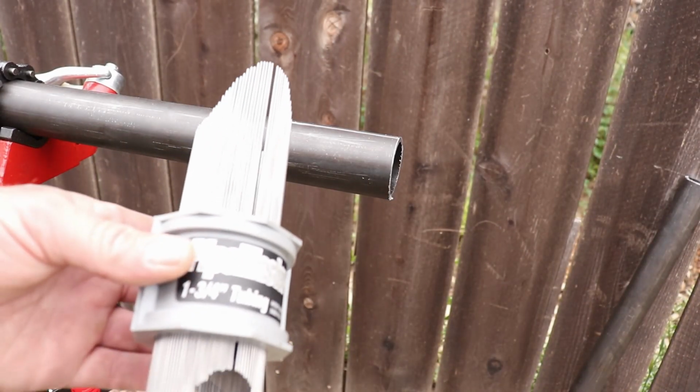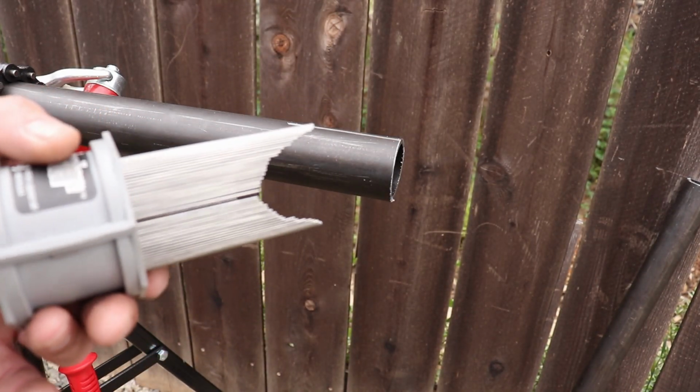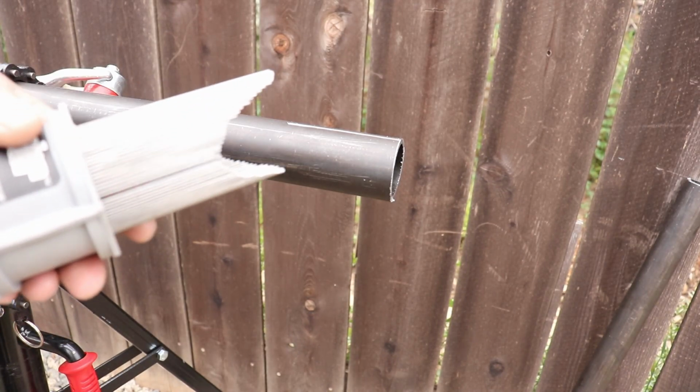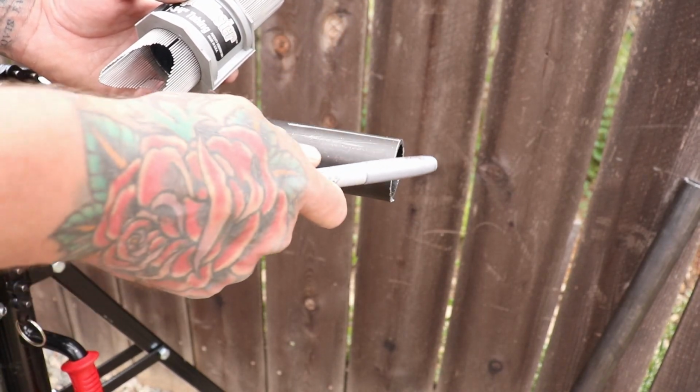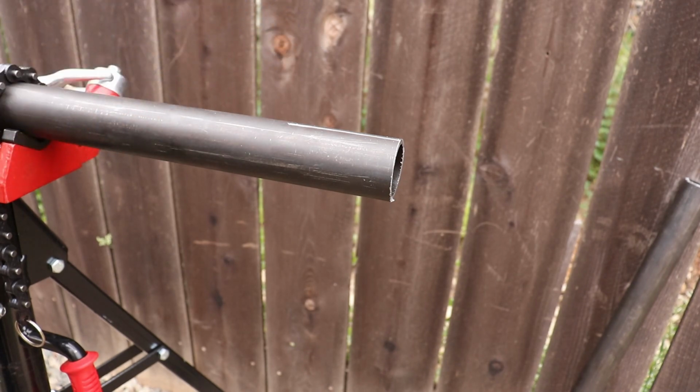Alright, so if you're going to be using a pipe master to figure out your cope and draw it on your tubing, it is a snug fit, and I recommend filing the end first. That way it slides on easy.